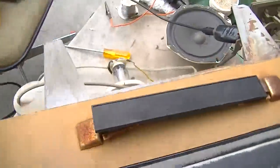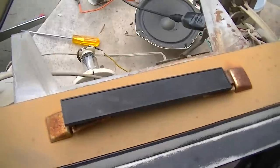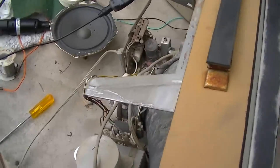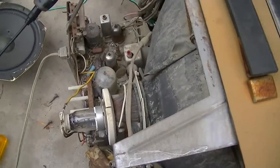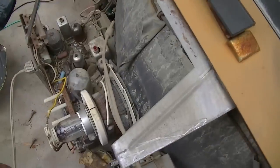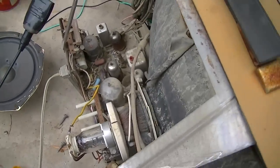So next thing I want to do is get it in the house, hook it to the DirecTV so we can see the picture. It's gonna be good. You can't see it out here because I'm outside, but I'll run it on reduced voltage in the house. I'll knock it down to about 110. That'll probably get it down below where that yoke is arcing. And let's just see the picture on it, and then we can decide. I got varnish. We just pull that yoke off and clean it up a little bit and put some varnish on it.